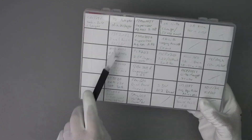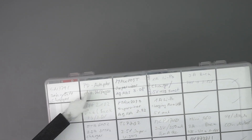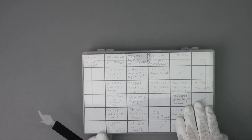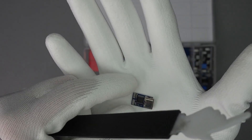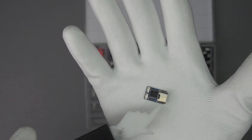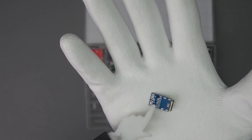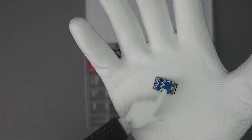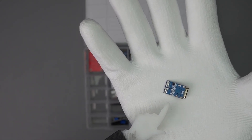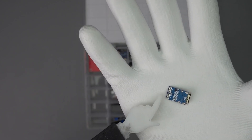The next one is in one of my boxes. It is named Power Two and its name is PD adapter with diverse voltages. This is the chip for the board, which is basically only one chip plus a USB-C connector. On the other side, we see markings 9V, 12V, 15V, and 20V and an output. This device is compatible with the power delivery mode and it signals the power source which voltage it should present to the output.